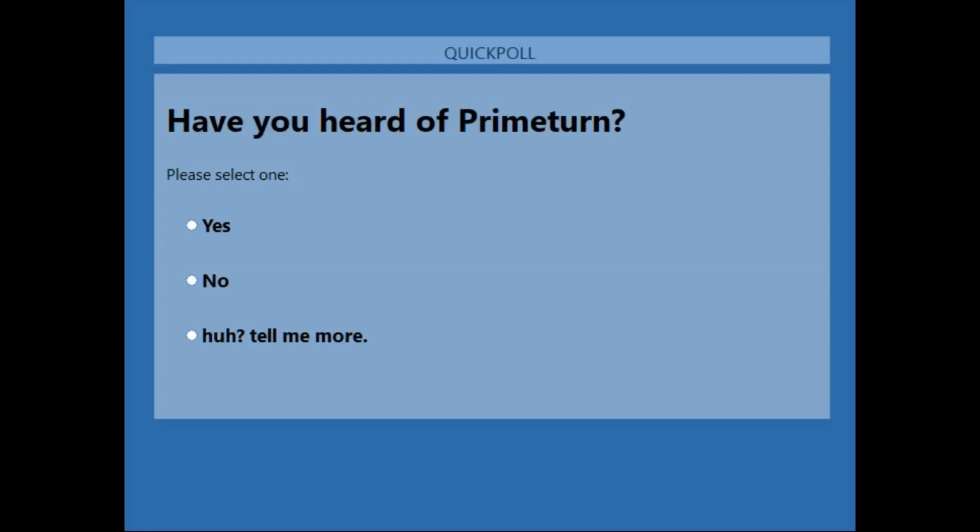There's a video I can link you guys to as far as what Prime Turning is, but essentially it's a proprietary cutting format from Sandvik where they basically reinvented the way that turning could possibly work, where its main cutting direction is actually cutting away from the spindle of the machine.